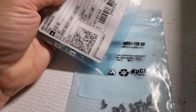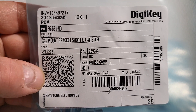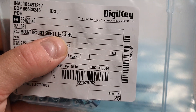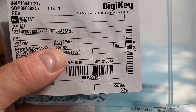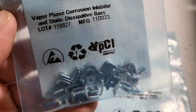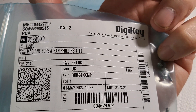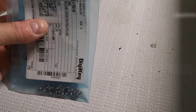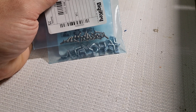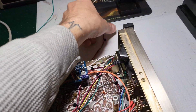I used an angle bracket to mount it — I get these at DigiKey, the part number is 36-621-ND. These are 4-40 threaded, which is probably the equivalent of about 3 millimeters, what you'll find in most of these radios. They're already threaded so you don't need a nut on the other side. I also use 4-40 pan-head screws. I go through these quite often and I'll probably use two more for the clock board.